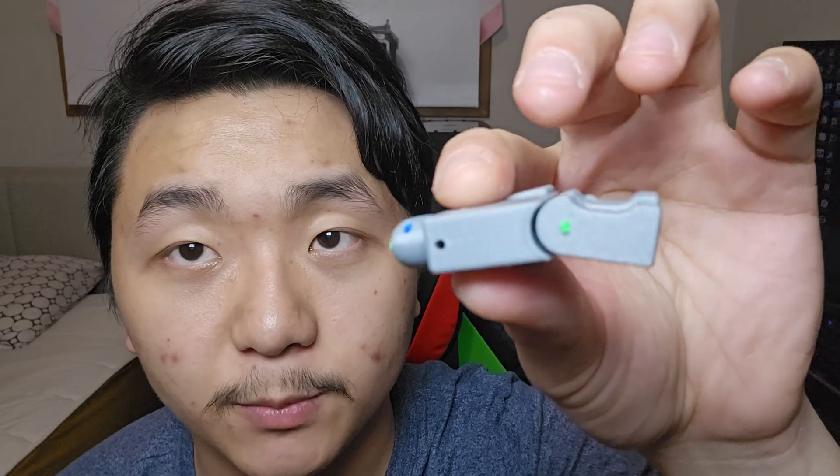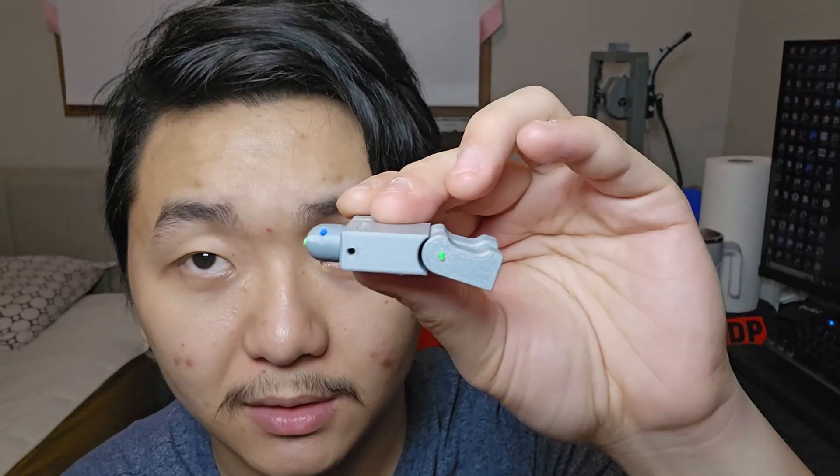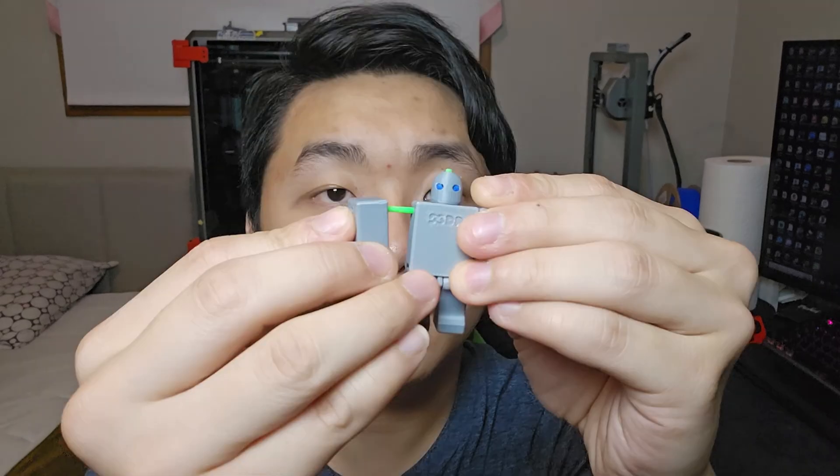The arm hole is actually a lot smaller than the body hole, because the body is printed with the hole pointing sideways. When I print holes pointing sideways they tend to come out a little bigger, making it easier to insert the filament. But when the hole is pointing up during printing, it tends to come out a little smaller. So this hole is 1.9 millimeters and this one is 2.1 millimeters — same filament, just different print orientation. But they still fit together really nicely.